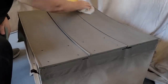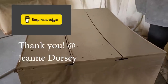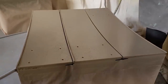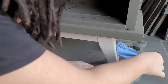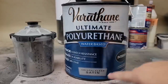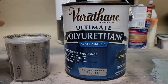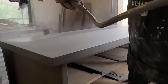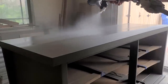I'm so thankful for all the love and support the channel gets, and I want to give a special shout-out to Jean, or Jeannie Dorsey, for buying me five coffees through my Buy Me a Coffee. After all the paint dried and I removed the tape off the base, I'm honestly not sure if I'm happy with the way it looks. I decide to keep moving forward and topcoat the piece using a water-based polyurethane in Crystal Clear Satin Finish. I add the topcoat directly into the same container that had my paint and mix them together — this gives it a slight green-gray hue. Adding a little bit of paint into your topcoat when working over dark colors helps avoid streaks.